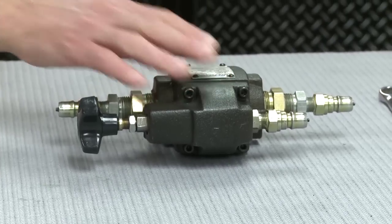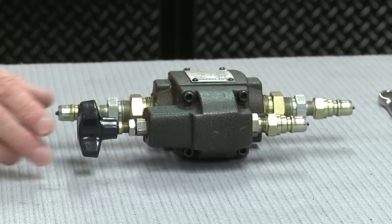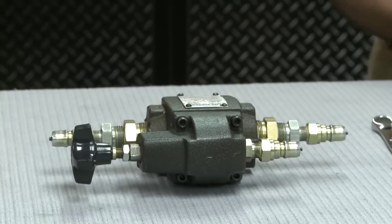The relief valve that we have there — why is this feature so important as a safety feature? The relief valve limits the maximum pressure in the system and protects it. If we have too much pressure, we could wind up blowing lines or even causing a component rupture, which is not safe, particularly for workers around.